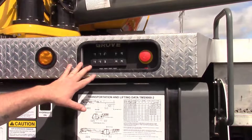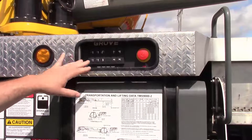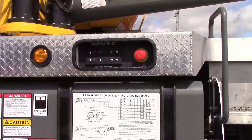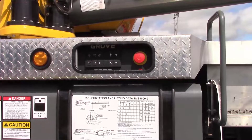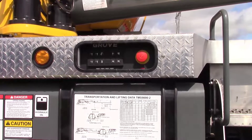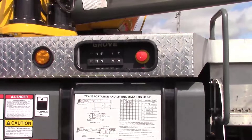To activate or originally set the system up, you want to fully raise the machine up and level it on outriggers as we already have, then apply cribbing to the fifth jack underneath the front of the machine and run the jack completely down. At this point we'll show the fifth jack being run down and then continue on with operation.